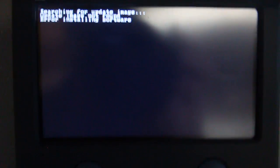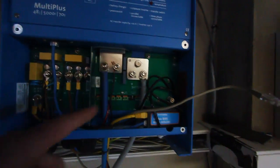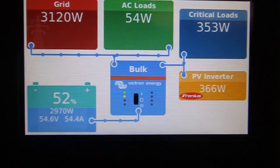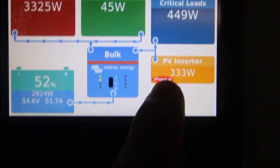Color control is updating to the latest firmware, which is 2.0, designed for ESS. Here is our Victron with the VE bus BMS battery management system — 4 lithium batteries, 160 ampere-hour each, making close to 8 kilowatt-hour capacity. Charging batteries from the grid right now; the turbine is giving 350 watts. The Fronius logo appears here, but it's not the Fronius inverter — it is this inverter.